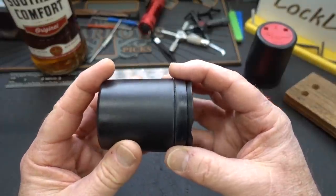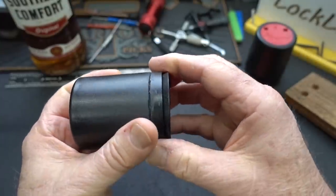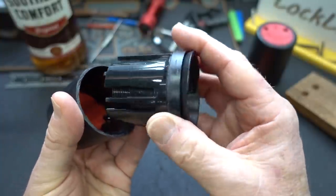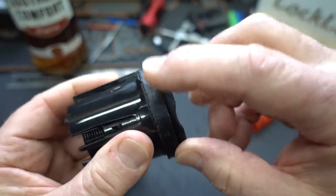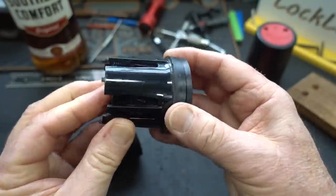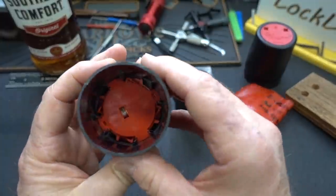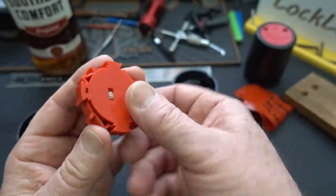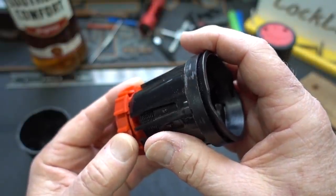Let's figure out what that was. It looks like David cut it right here, and I just know stuff's going to come shooting out. There's that inner sleeve that pinches down when it's compressed — so we have the compression ring. That's part of the outer sleeve right there. When it pushes down, it compresses these and clamps that down on the neck of the bottle. You can see how the top of that links up with those slots like that.